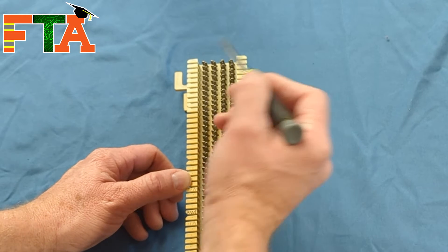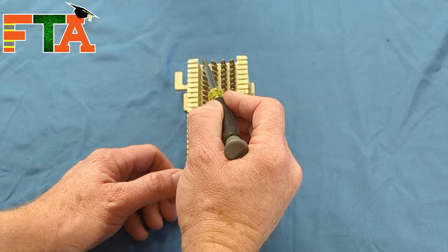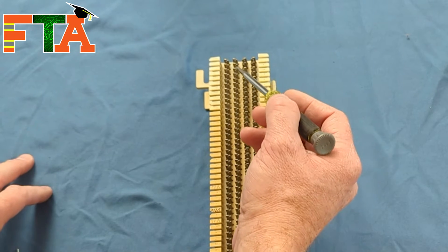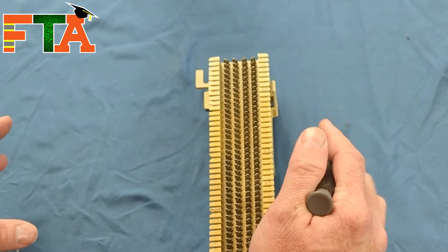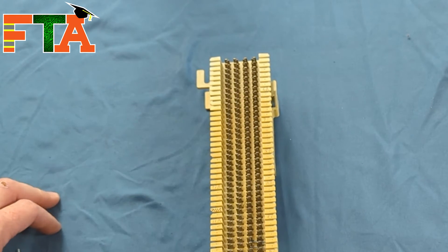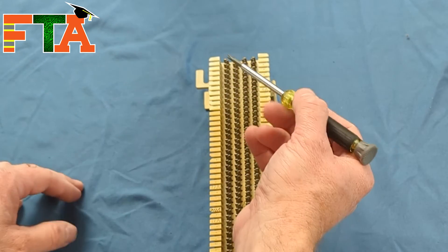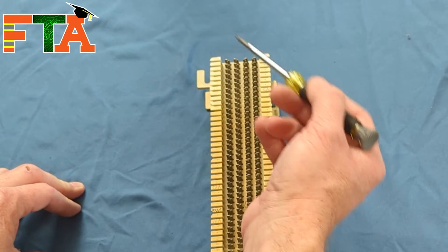The signal will not automatically cross to the other side of the block. You've got the right side with two pins, and the left-hand side with two pins. Anything you connect to pin 1 will be on pin 2, and anything on pin 3 will be on pin 4. Most of the time, the telephone company will bring in their cabling on one side or the other — there's no set standard. So it can come in on the right side or the left-hand side.